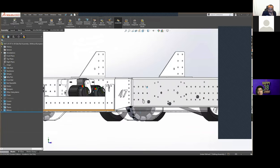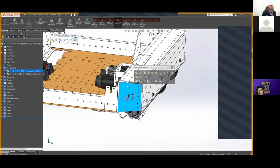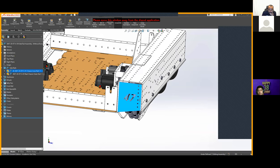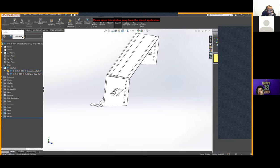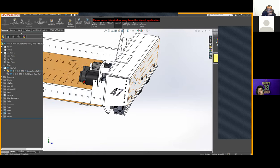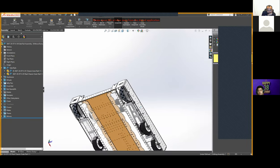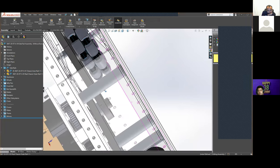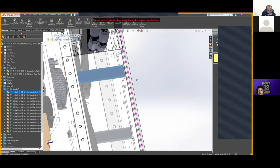The drivetrain inner and outer rails are both sheet metal parts. This part creates the inner part of the box, and this outer part creates the other half of the box, and then it's basically just a box that contains all of the wheels and chain and everything. We use 7/8 standoff in the drivetrain to make sure it didn't collapse or get bent, because we've had trouble with that in the past.